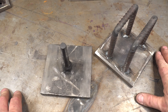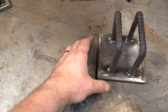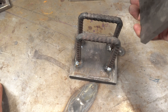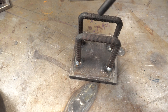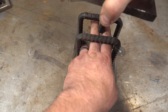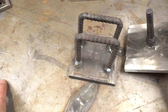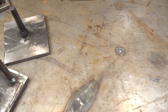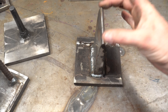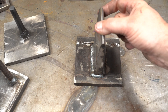Next up, some utility dies. This is a punch — really it's a set, because your workpiece will go in here. This is for doing hammers and axes when you want to punch the hole. You punch down and as you pull up, these bars will knock the piece off so it doesn't stick to your punch. And of course there's a splitter for doing feather Damascus — this is just a big hunk of steel that I drive through a piece to create the feather pattern.